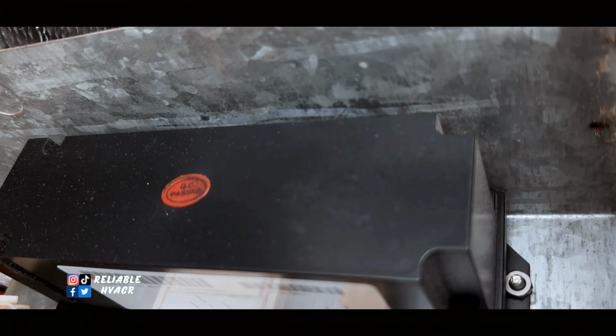And like I said, we're gonna cut out that piece that's leaking, eliminate a weak point, because it just hangs and it ends up cracking. The little T that comes off, and then change out the dryer, vacuum, and it's 404. I have plenty of that, so we're good. Let's get started on the rest of it. And we'll get the trusty old torch kit. I've shown this before, but it makes life so much easier. So we'll get that down real quick.